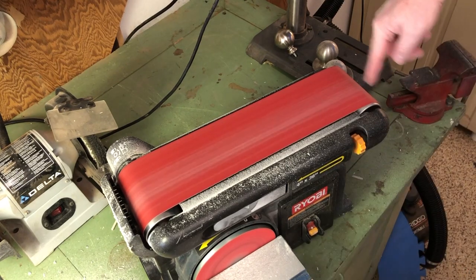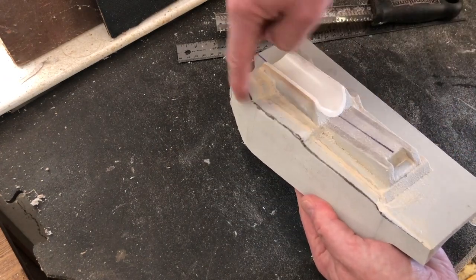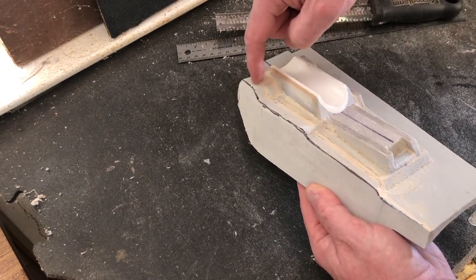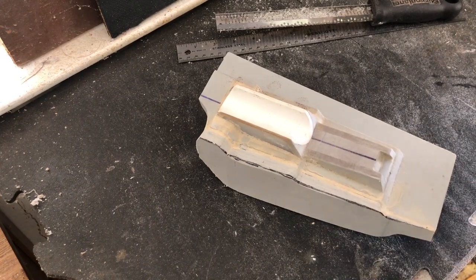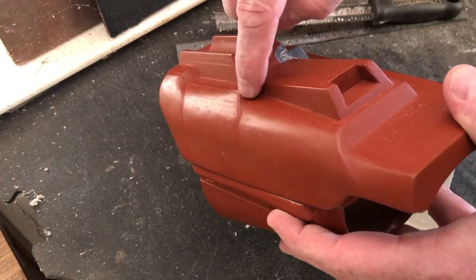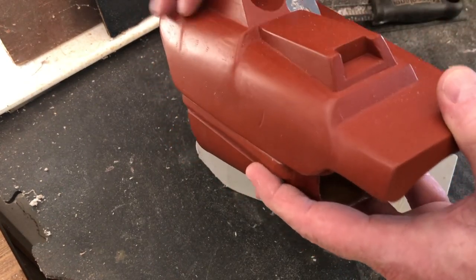The radius right along here is just a little bit too large to deal with on the belt sander, so we can do it by hand. We've got this taken care of and now we just want to go ahead and round this off so that there's a transition. You don't want to round off the original part - you want that to stay pretty straight - but from there on you want it to kind of curve down. I'm just going to show you this as a sample: keep these sharp areas here, we'll curve them down and actually cut these in shortly after. We're just going to do a general rounding over first.